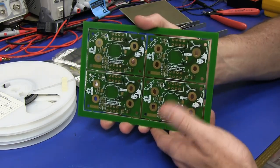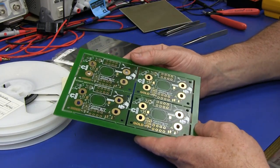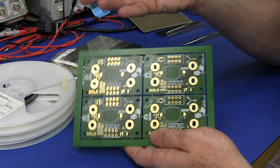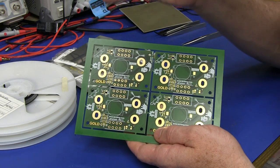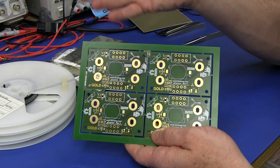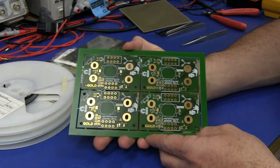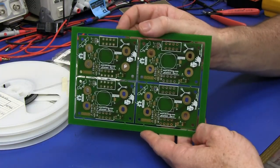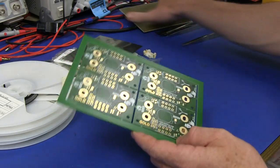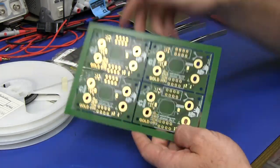microcurrent board in my new thermal oven, and there's no issues at all, because who knows, there might be thermal issues with the parts. For example, all of the precision components, I want to make sure they're still in spec after they're reflowed in my thermal oven. I'm pretty confident in the thermal oven now, although I have to play around with using just a sheet of copper in here, as I'll explain later.